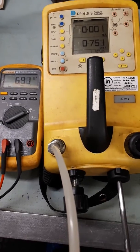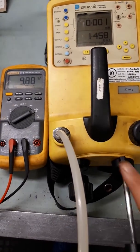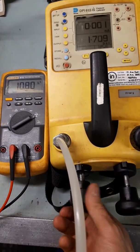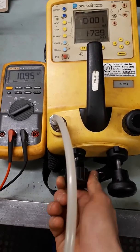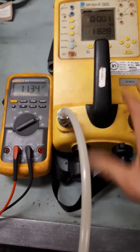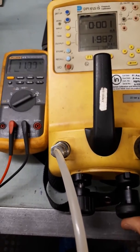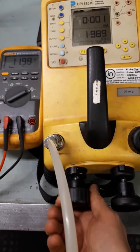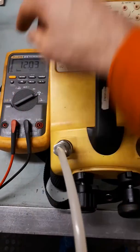Now that we have enough adjustment it's time to start pumping up. If we go to 50% of the range first, that means we need to pump the pressure to 2 bar. The range of the electrical output is 4 to 20 milliamps — that's a range of 16. Half of 16 is 8, so if we add 8 to the 4 we should get 12 milliamps when we have 2 bar. Here we can see we're approaching 2 bar. Use the fine adjustment to get it to exactly 2 bar — there we have 2 bar, and the multimeter reads 12 milliamps.